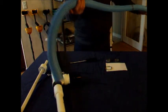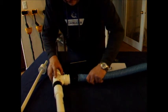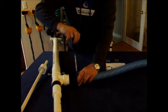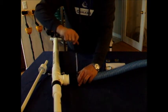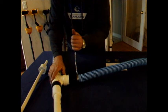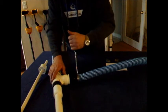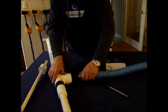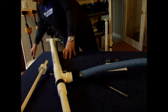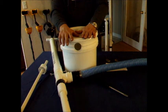Now we need to attach the hose. Take your six-foot hose — it has a hose clamp on it — and put it on the discharge port, then secure the clamp fairly snug. There's a lot of pressure developed in there, and you don't want to blow the hose off mid-downstroke and have all your material chucked back into the river.